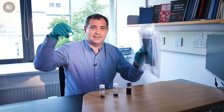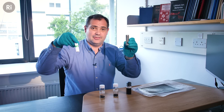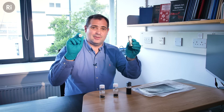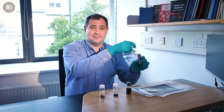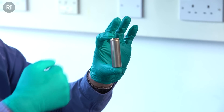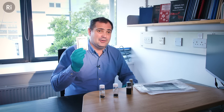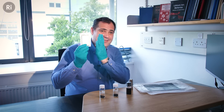That sandwich is then wrapped into different formats. So here we have our format for a cylindrical cell, which is something you might be quite familiar with. The idea is we take this rolled Swiss roll of our electrode negative and positive sandwich and place it into the casing. Then we can add the liquid electrolyte that allows the lithium to go back and forth between the electrodes. We also have more pouch cell style, like in your mobile phone, and in those cases we can view them as lasagna — layers stacked.